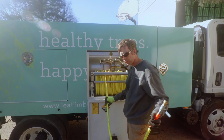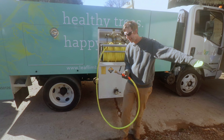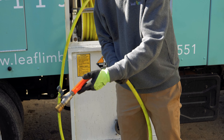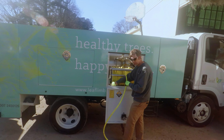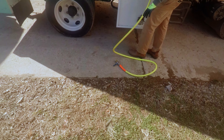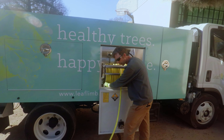If you have all your hose out and you're trying to reel it up, bring the end of the hose close to you so it's not dragging across any pavement. If you're dragging it, it's abrasive — you're going to damage it and damage the ball valve. Keep it close to you when you're reeling up. There's one button right here on the electric reel that reels it in. When you get towards the end, keep your eye on it because if it's going too fast it could whip up and hit you or damage something. Keep it close so you can keep your eye on it.